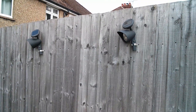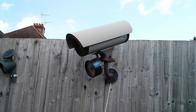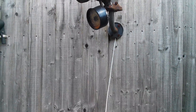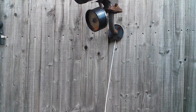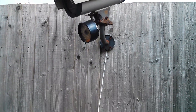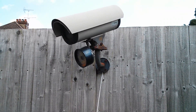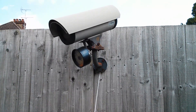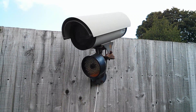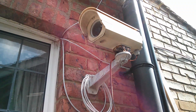Morning all. Right next to some of my little solar lights I have one of my IP security cameras — these are the genuine thing, they're not dummies, these actually work. Inside there's an IP camera; this one has a single Cat5 cable running to it — that's Ethernet. The power also comes up that Ethernet cable; this is Power over Ethernet, so you've got 48 volts DC running up two unused lines of the eight lines inside that cable. Inside the camera there's a little buck converter which switch-mode regulates that 48 volts down to 5 volts for the electronics.